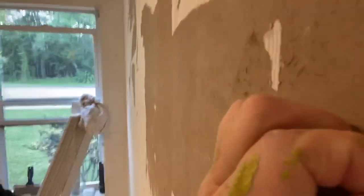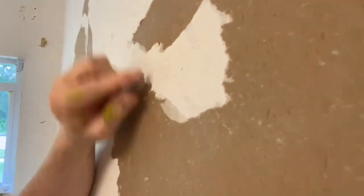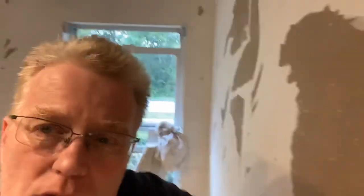I'm going to go to my scraper and scrape off all of the loose particles. If you start pole sanding this, here's what's going to happen — it's going to rip, just like this. It won't sand off the edges, it'll just keep tearing. So you have to get these little pieces off. Don't try to pole sand it and save a few minutes. Let me show you how to use your scraper.